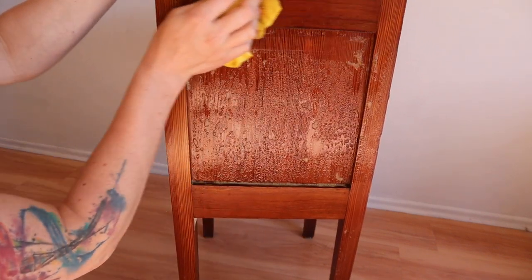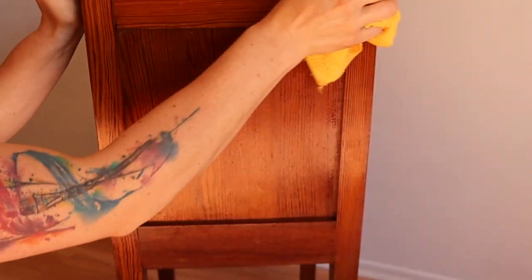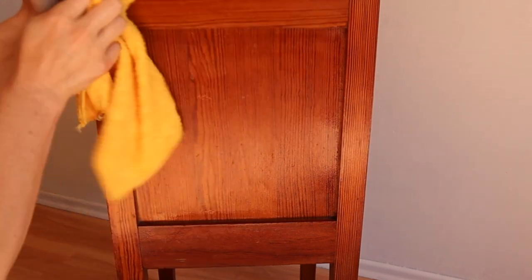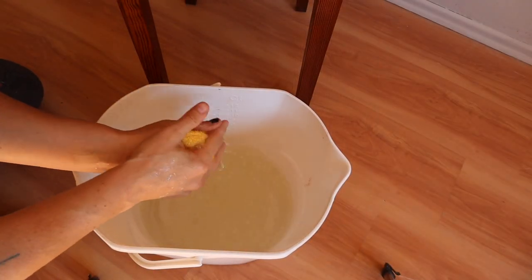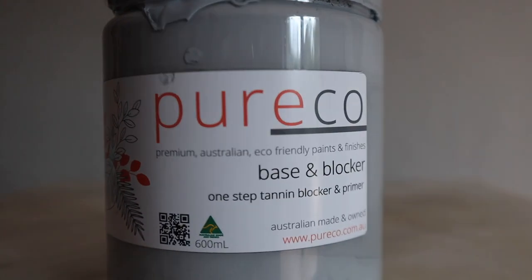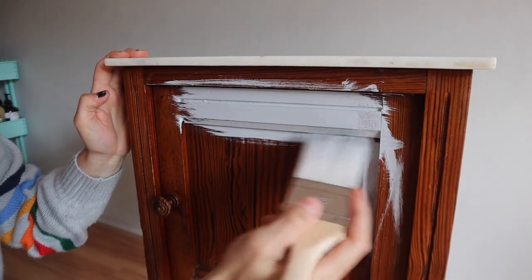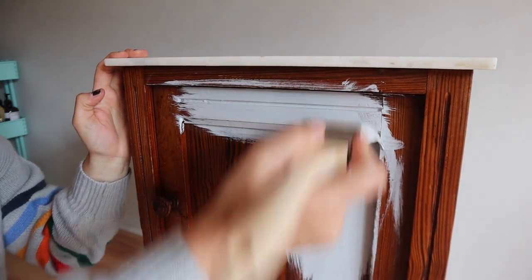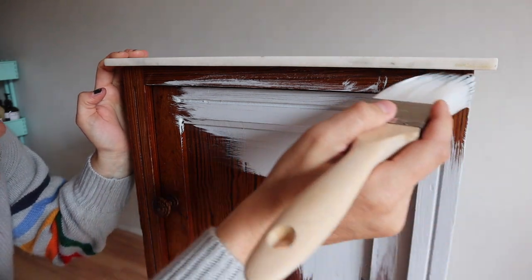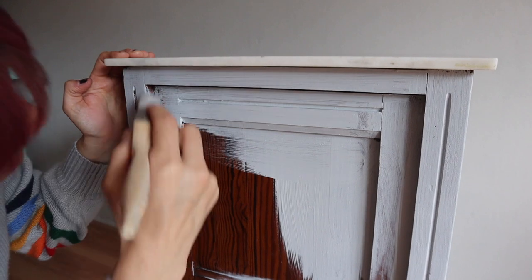So I want to take the proper steps to make sure that I do not have problems with bleed-through later on. I'm going to clean this piece really well — a couple times — and then go over it with clean water and a clean rag. Typically I have gloves on when I'm doing this; I'm using the Green Ease cleaner right now. So wear gloves. You're going to see that the water is not super dirty, but still a little bit tinted. So I'm going to go over it with Pure Eco's gray blocking primer before I use the paint. We will be using Country Chic's paint, which is an all-in-one paint, but it's suggested that if a piece is going to have problems with bleed-through, put an additional primer down — it's going to save you time and a headache.